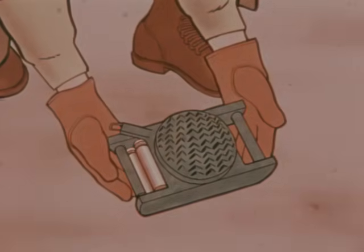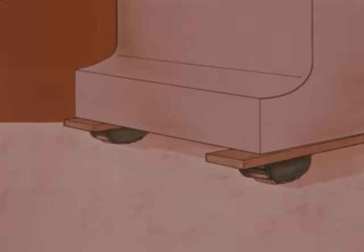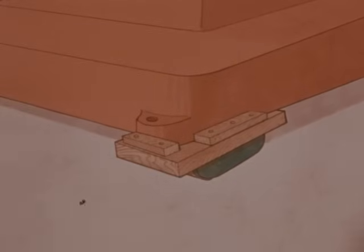Endless roller chain skids operate around a load-bearing frame plate which supports the load. They may be the swivel type, the straight rigid type, or the swivel and lock type. Roller skids are placed as directed by the shape of the base of the load. The hardened teeth furnished on all type skids furnish the necessary friction by firmly embedding themselves into the wooden planks which are placed between the skids and the load. Always avoid metal-to-metal contact. Short pieces of planking just long enough to cover the skids will usually be enough. Care should be taken to prevent the load from sliding on these planks; an easy way to accomplish this is to nail chocks to the planking in convenient places.